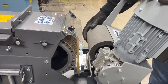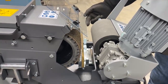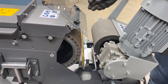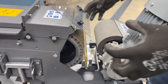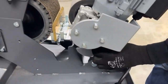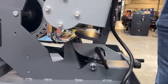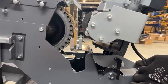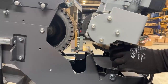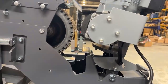The first thing we're going to look at is the centerless grinding attachment and all the different adjustments. This rubber wheel on the centerless attachment is a motorized wheel called the brake wheel, and this wheel is actually rotating backwards — or upward as far as the tube is concerned. It creates a counter action to the grinding wheel, which is trying to push down on it, so the tube ends up spinning along this guide. This stop basically allows the brake wheel to get closer to the grinding wheel — it needs to touch the material but not bump against the grinding wheel.